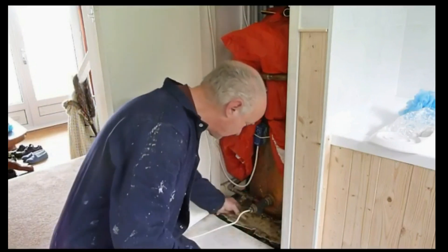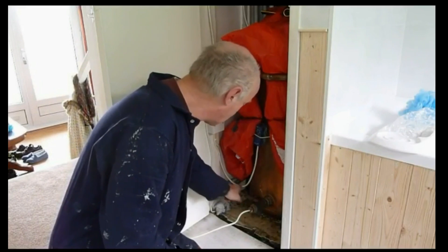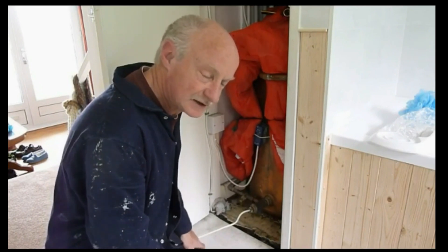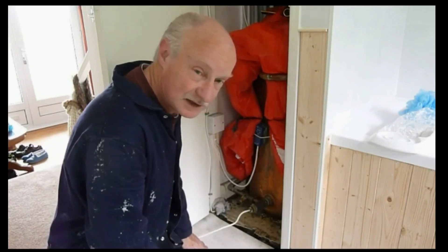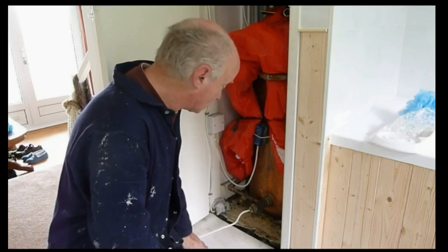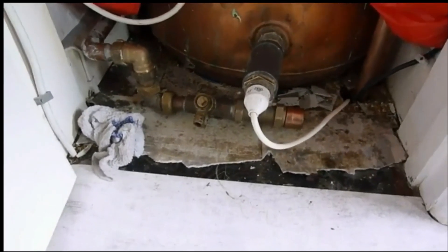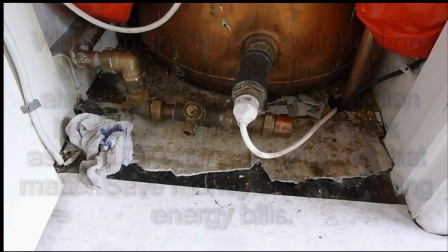I'm going to make this T-piece up at the bottom because we mustn't allow hot water to go up the cold feed into the roof tank. This element is only just fitted because it's an extremely thin tank — it's only 15 inches in diameter, one of the old ones. Most tanks will be 18 inch size; you'll have no problem at all, it'll go in easy. There is the finished article as it should look, if you can get it into your cold feed at the bottom of your storage tank.